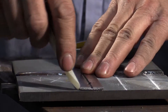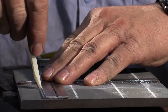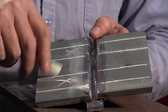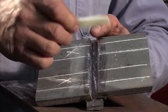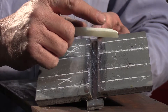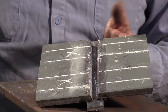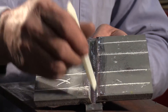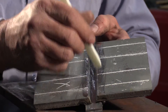Always a good idea. This is the area you don't want to have any trouble in. If your wire welder is acting up, if you've got a stop for whatever reason, a gas issue with flux core — I don't want any trouble in these areas. This is where I'm going to bend the root bend and face bend. The center part is where, if I have an issue with either one, that gives me a third option to redo it. The inch on the bottom and inch on the top I disregard and throw right out. Nice to have that, especially welding 7018 where the electrode means I have to stop. I like to stop in the middle area and try not to be in the bend zones if I can help it.